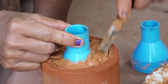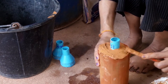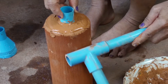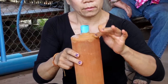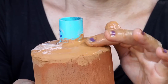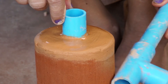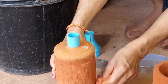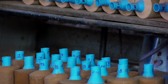Continue filling the hole with grout, tapping out the water. Keep spreading the grout until it covers the rim of the filter. Always remember to tap the filter to remove excess water. Use a damp towel to begin smoothing and cleaning the grout. You can use your fingers to smooth and shape the grout. Remove any excess grout from the filter. Tap any remaining water out and give the fitting any final adjustments. Wipe off any remaining excess and prepare the filters for storage — they'll need a few days for the grout to cure.